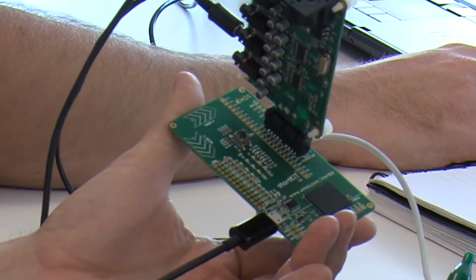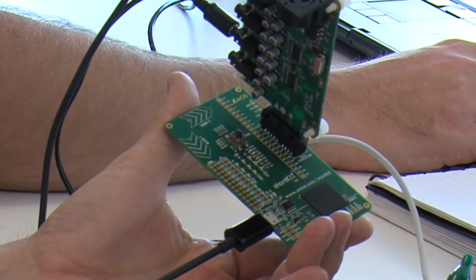The other thing I've got is on these sliders here, these capacitive touch sense sliders, I've got another effect for those who enjoy technology, which is a Dalek voice transformer, a thing called a ring modulator, which allows you to play with the depth and frequency of what's called an LFO, which allows you to modulate a voice to sound like a Dalek.